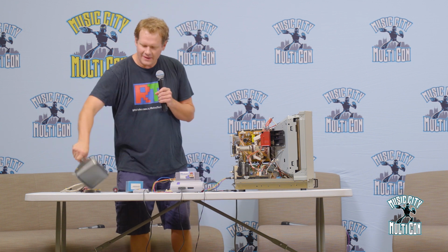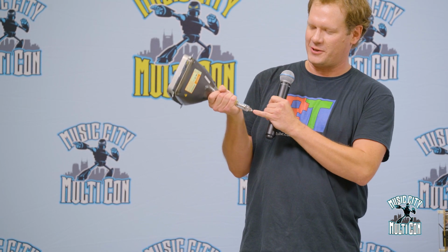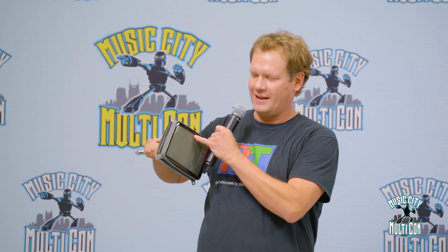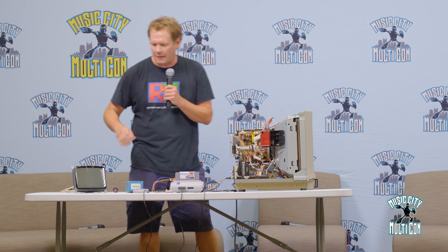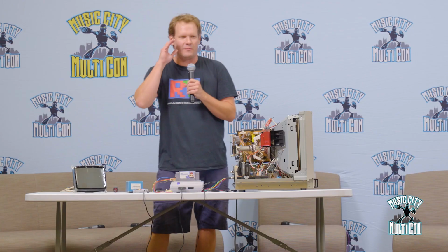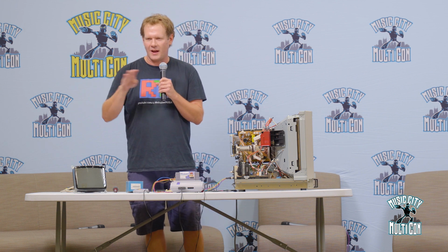Basically the way this gets an image onto the screen is the information that you're going to display through your pictures is sent in the back here, sent through a board like this. In here, it goes through this device inside the glass, which is called an electron gun, and then your image is blasted in beams on the front of the screen. So it's a completely different technology than our normal technology, and that's why there's a lot of weird, almost tricks and magic going on when it comes to a CRT, because if we could slow it down, we would see that all that's happening is these lines are being individually drawn on this tube face of the mask, and all it does is it does it at such a high speed, our eyes can't see it. So we don't see the flashing or the blinking. We just see it as a smooth, constant image.